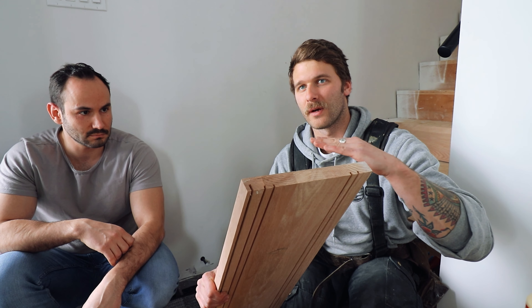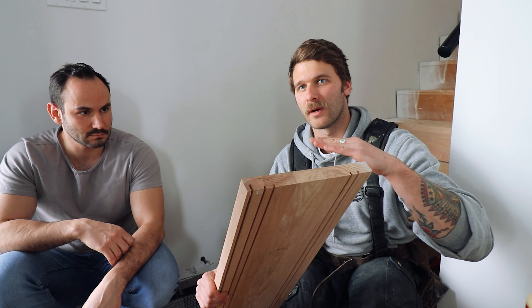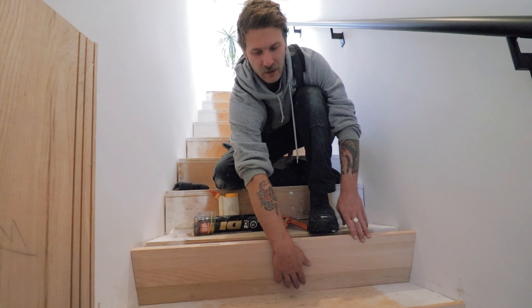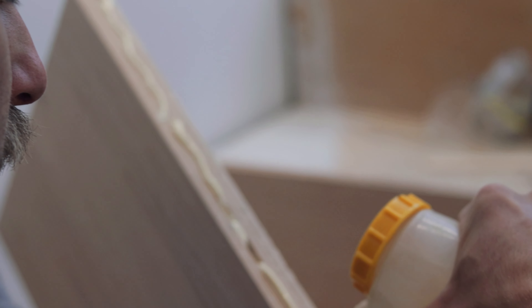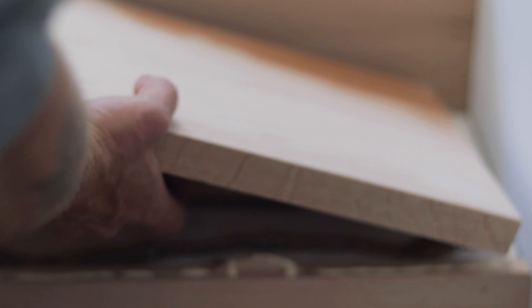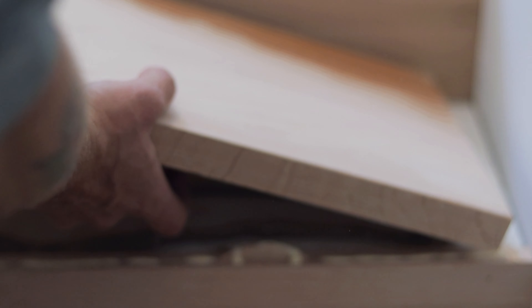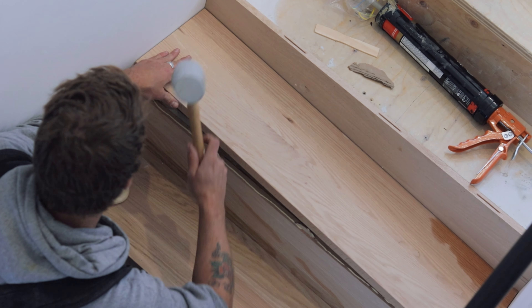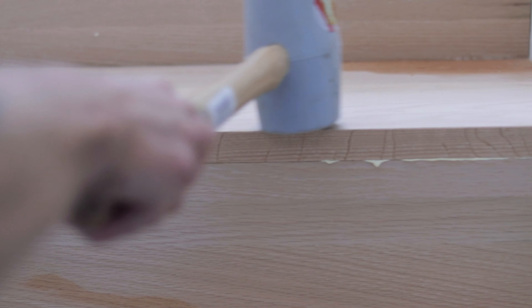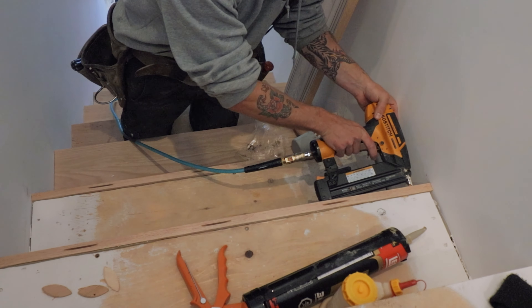When we're assembling the steps we've run into a couple of challenges. It's difficult to get everything to line up with the drywall because it's never quite straight, so we'll need to do a little bit of drywall patching here and there. Basically what we're doing to start is putting the riser in place first — one riser, then the next one — then sliding the tread in after, which allows it to butt tight on the back side with the glue line at the back. Then I'm sliding the biscuits on the nosing into place and running wood glue along the top of the previous tread, and the whole thing sandwiches together with the biscuits holding that front joint tight. Then we're doing PL all along the tread which bonds to the underside of the yoke — the kerfs increase that bond and the PL hardens to stop any squeaking. Then we're shooting two inch brads through, which will later be filled and sanded prior to finishing the treads.